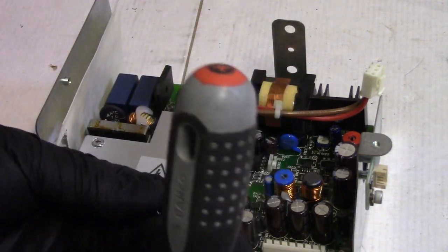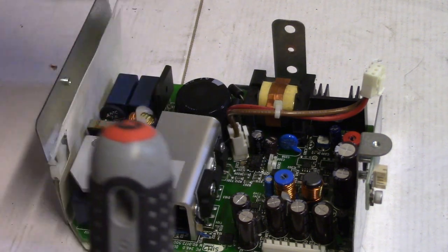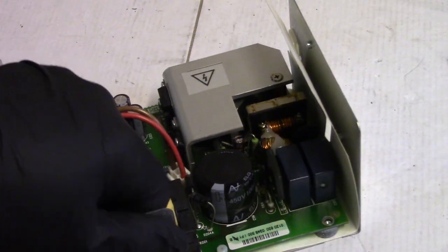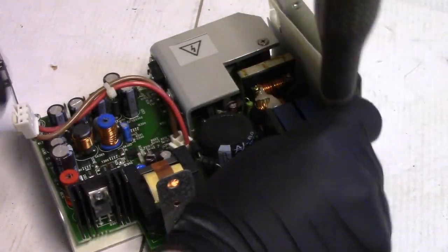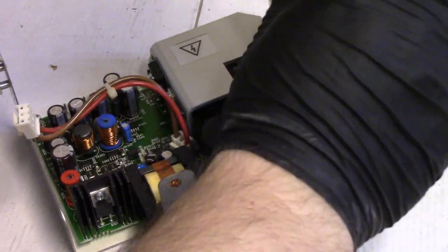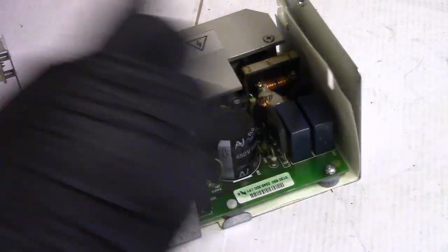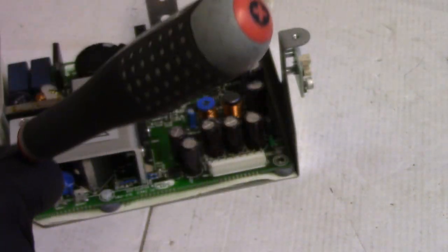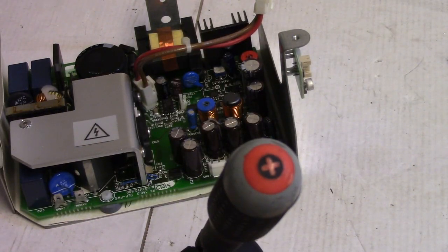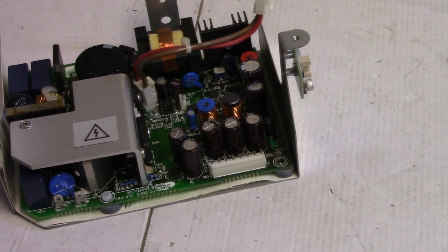I don't know how well these star washers really work or if they work at all. I hear conflicting things. I can see physically how they're expected to work, but I don't know. If you get it that tight where the metal's going to dig in, I mean, they're not super heavy, so I would expect them to crush before they really dig into the metal. Though I could see them digging into the circuit board, so maybe that's the idea. I don't know.